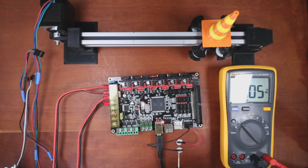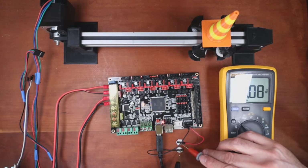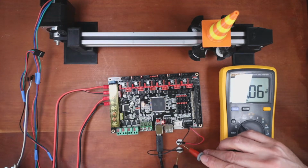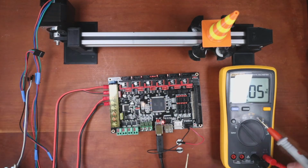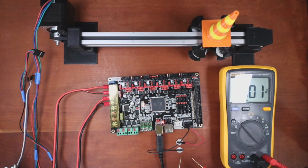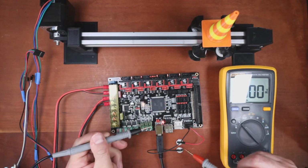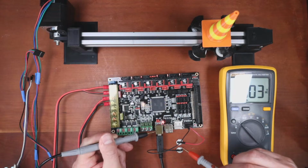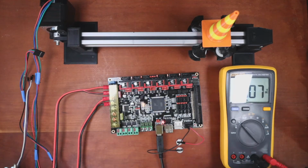So let's try over here. There we go. That's 5 volts exactly. It's just what I was set on. So I'll show you again. I'm set on the one that looks like it's got an averaging on it. Right there. So it's 5 volts. Another way you can do this is ground, because it's a ground plane that goes into the board, and you can do it there. So just a little trick in electronics that might help.